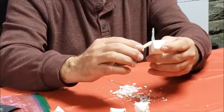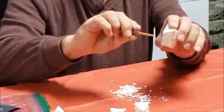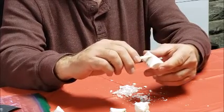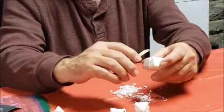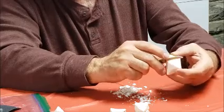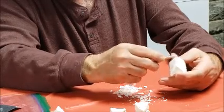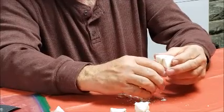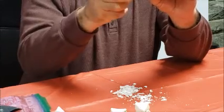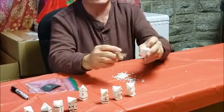That 45-degree angle is very common in chip carving and caricature carving, and that'll define the beak. Now to make the beak shaped, take the tip of your blade — just the end of it — start at the outside edge and just make a little scooping cut out of there. That will define the beak and give it a hook shape like the curved beak of a predatory bird.